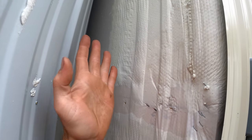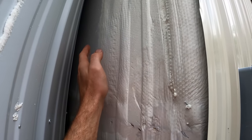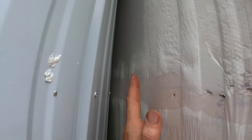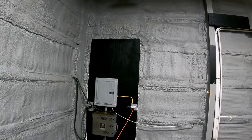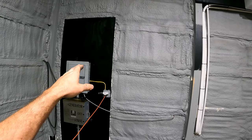It's not a huge deal, but as winter approaches, hot humid air inside and cold outside is going to cause sweating inside that cavity and then create mold, mildew, and eventually rot and termites. I'll go ahead and get that spray foamed from the outside too.